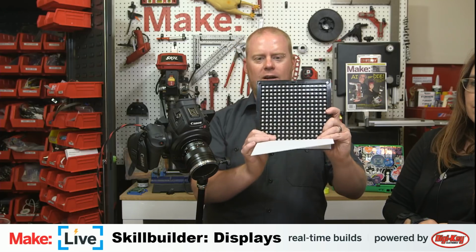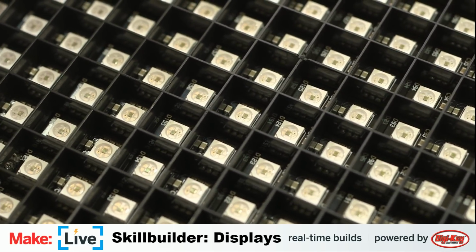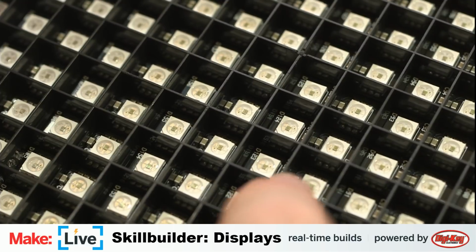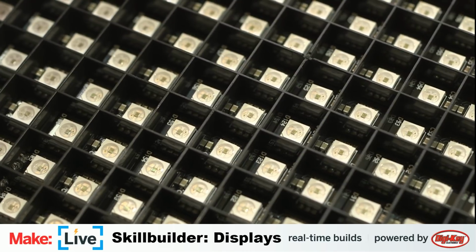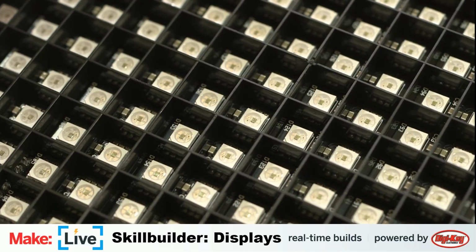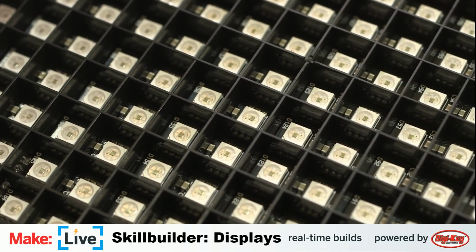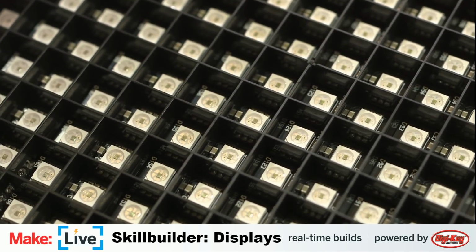But there is a whole bunch of NeoPixels. Don't want to lose any of this hardware because I do want to be able to assemble it back. Let's go to this camera here. Focus it in. And yeah, each one of these pockets contains an individual NeoPixel, and they all just handle their communication together. The reason they need to be in these individual wells is, as I mentioned, you need to isolate the light from one to the other. If you don't, they're just going to bleed all over each other, and it'll be a big, messy, blurry display. But here, you just turn each one of these into its own big individual pixel.